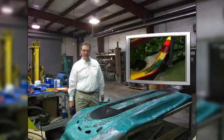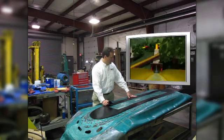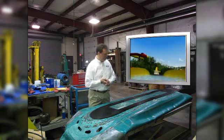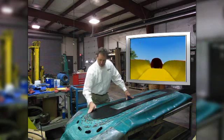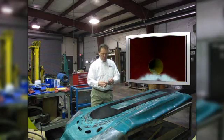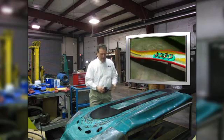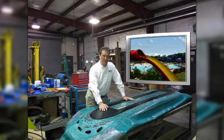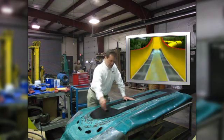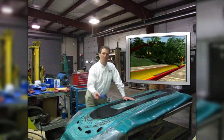Welcome back to the Crown Plastics Maintenance Department. As you can see, the raft has been completed. What we used is a .093 UHMW, and the adhesive was a contact cement supplied by a company called Clifton Adhesives. We had to grind off the excess rubber that had been bonded on the side and focused on the really high wear areas. When we bonded the UHMW and let that contact system cure, this baby is really bonded — it is a very, very secure bond. As a reminder, this was an application where a pressure sensitive system would not be able to withstand the rigors of this environment. In addition, with the treated-for-bonding material, you were not going to be able to physically abrade this PVC film, so the only way to get this application to work was to use a contact cement.